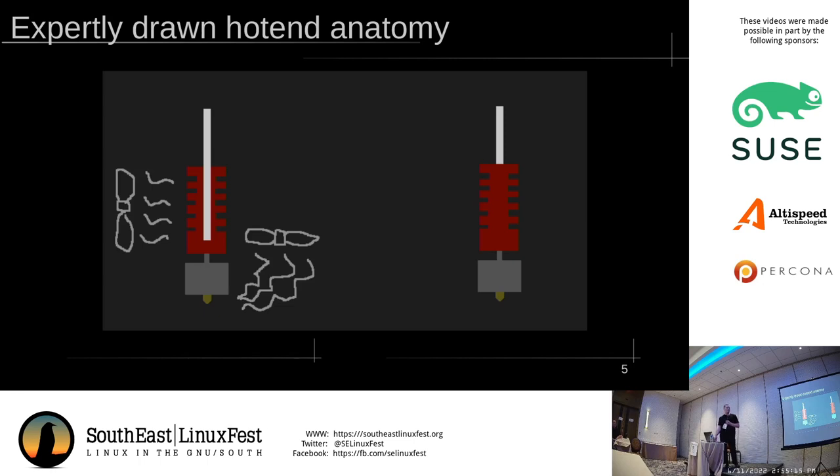For the hot end, you generally have two types at the low end. One is the lined hot end and the other is the all-metal hot end. The reason for a lined hot end is the Teflon tube goes all the way into the hot end, almost to the heater block. The advantage is it's easy to tune with plastics like PLA that tend to have clogging or stringing issues. The disadvantage is you have a hard temperature limit — when it reaches about 250°C, it will start breaking down and leaving toxic fumes. So lined hot ends are only for PLA, ABS, and things in that temperature range.